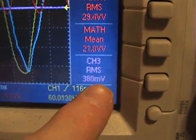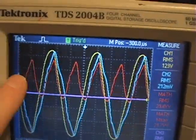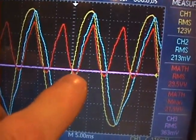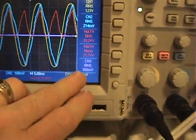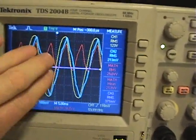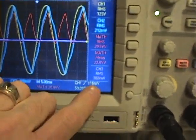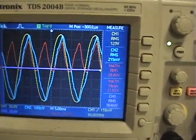Nothing is going across our load yet because I haven't turned it on. As you can see, the math is all on top — we are using real power and hardly anything is being returned, even though it's an induction motor. Now, before I turn on the circuit, because we're looking at 60 Hz on the grid side and the alternator outputs a different frequency, you won't be able to get synchronization for the third channel — it will just be moving by. But that doesn't mean we can't get an accurate reading on it; we will still get an accurate reading even though it's not synchronized with the grid frequency.